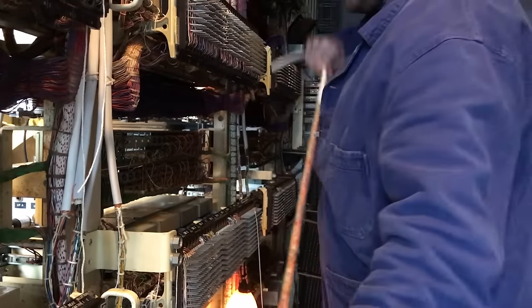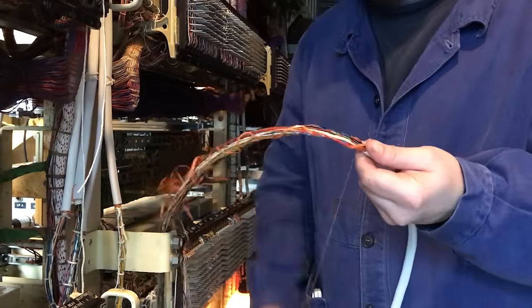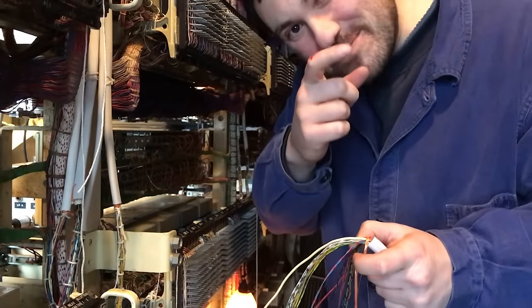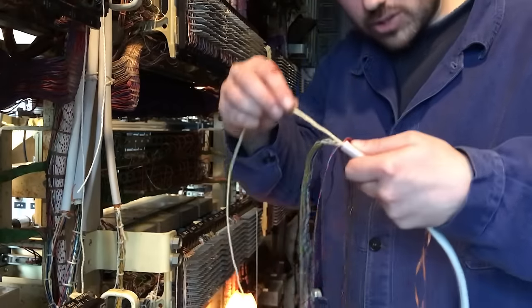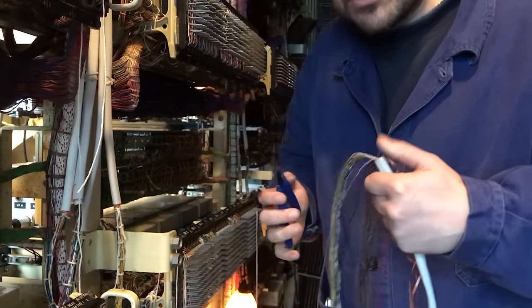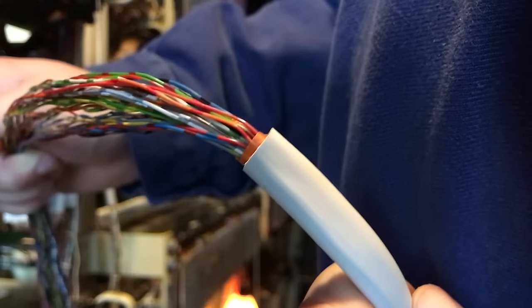There we go. It's got this plastic cover on there — you can just take your snips, snip it slightly on one side, and then it'll just come off. I just caught myself — you move yourself too quickly and catch yourself on these pins here. It's got a couple of little threads there that you can clip off. Disentangle these orange bits here. This particular 20-pair wire also has an earth cable — we're not going to need that, so we're going to clip that off, being very careful not to accidentally clip some of the cables that we do want. And then the last job is just tidy these little orange plastic bits around — just to tidy things up. That's the tidied up cable.